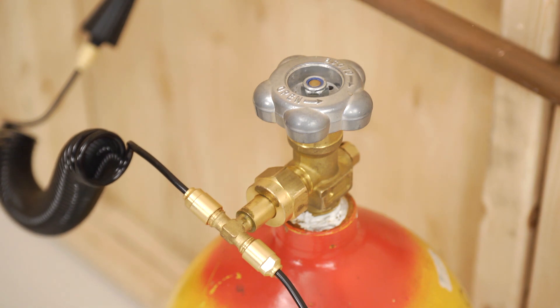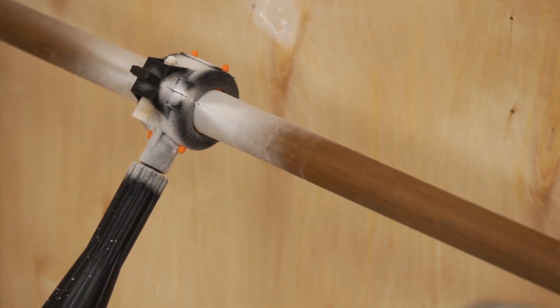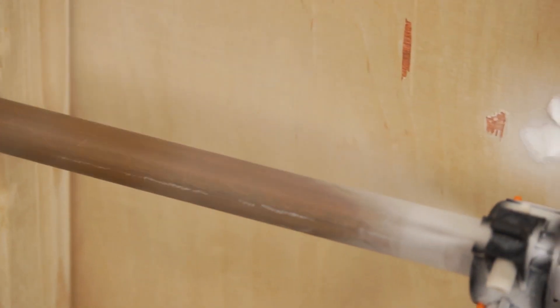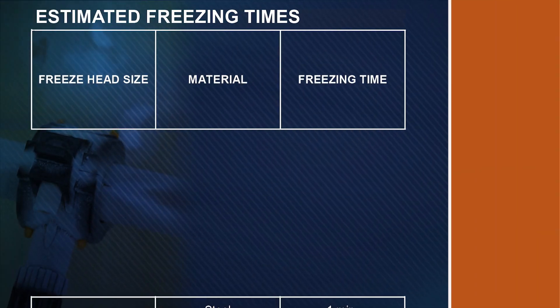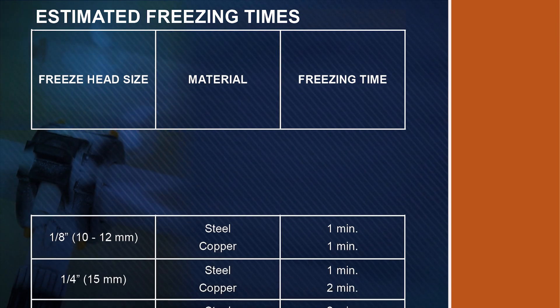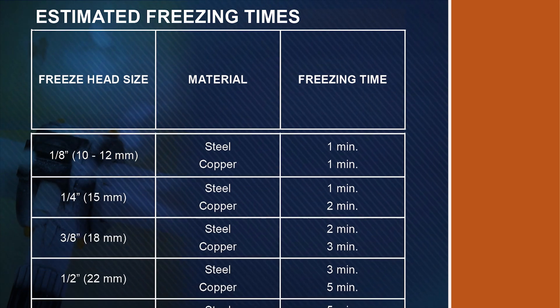The amount of CO2 required is controlled automatically. The liquid CO2 expands in the injector and forms dry ice inside the freeze head at a temperature of minus 110 degrees, freezing the water inside the pipe. CO2 sputtering from the freeze heads is normal. After a period of time, frost will begin to form on the pipe in the vicinity of the freeze heads. Freezing times and the amount of CO2 needed can vary depending on the type of pipe, diameter of the pipe, type of liquid, temperature of the water in the line, and the ambient air temperature.